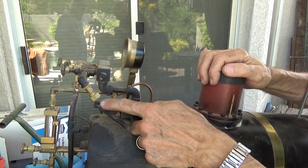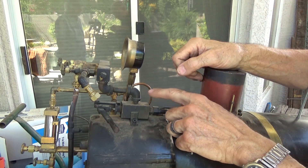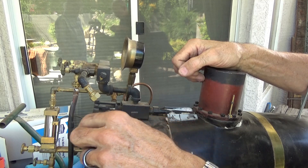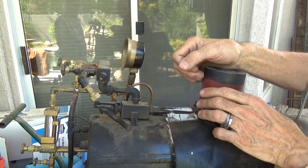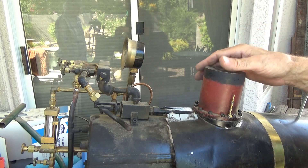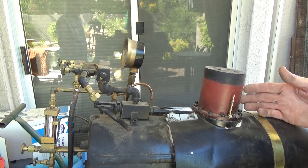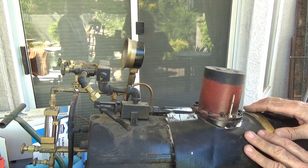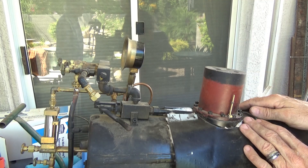Was there packing in here? There was packing in here. So this whole thing allows you to come off with the steam from the fountain and feeds the fountain from the steam dome, and the throttle linkage comes through the same delivery line into the valve that sits in this portion here. So we're going to remove this whole set of wrappers and turn the locomotive boiler over on its side to show you why we're replacing this as part of the cosmetic repair and rebuild of the locomotive. You'll see easily that it's not a terribly acceptable visual appearance on the underside, and I'd like to correct that for the sale of this locomotive.